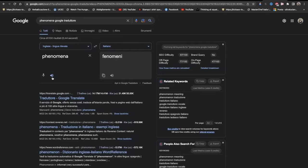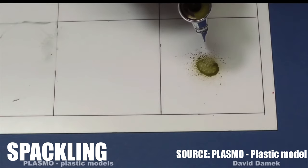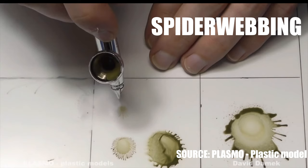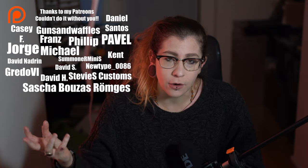There are two phenomena that will tell you your consistency is wrong. The first is speckling, which happens when you have too thick a consistency or too low pressure. The second is spider webbing, when you have too thin a consistency or too high pressure. Honestly, I haven't fully figured out a hard rule for this yet, and I can only share what I know — for me, you can easily adjust either way and it doesn't change too much. Number two is training the trigger finger.